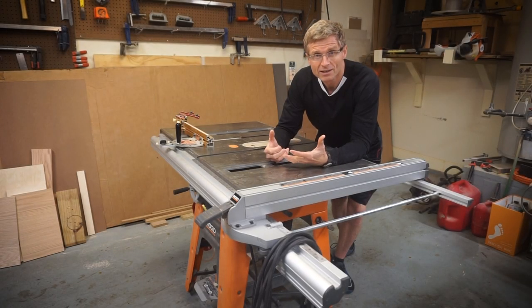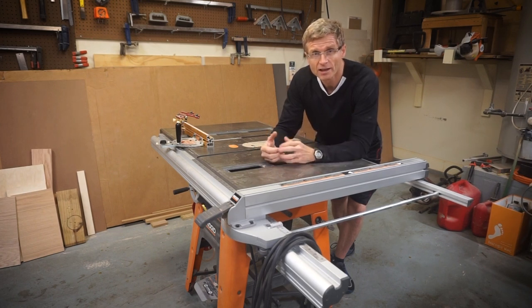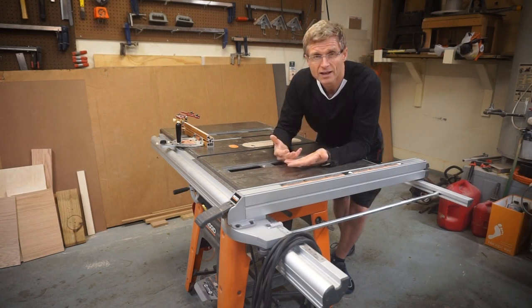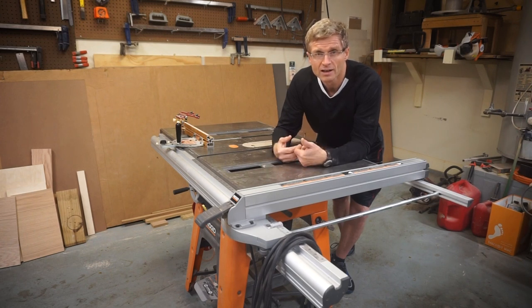When I was thinking about putting in a dust collector, I was worried that if I disassembled my table saw to install it, I would end up having to realign everything — the motor, the blade, the fence. But that's really not the case because the table saw stand is really independent from the table saw itself. I can unbolt the saw from the stand, lift it off, install the dust collector, put the table saw back on, and I won't have to do any realignment.